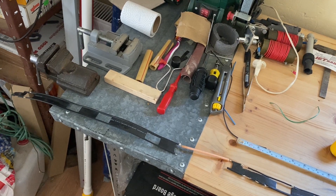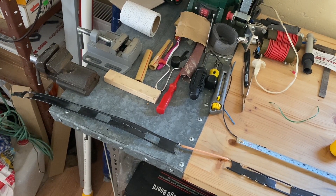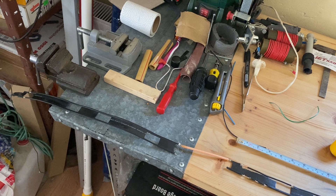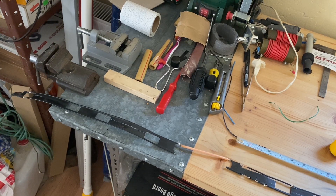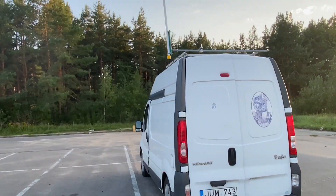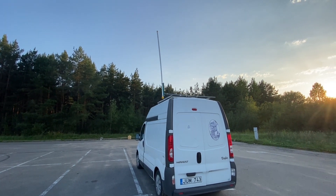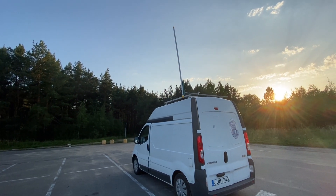These measurements may or may not apply to you, because I cut it for my needs — a center frequency of 145.5 MHz on the 2-meter band, and around 433.35 MHz on 70 cm. This is my European band layout. If you look at the original QST article, you'll find slightly different measurements. Please feel free to choose your own or make your own calculations.